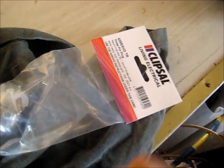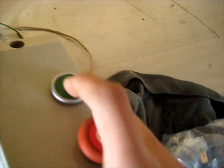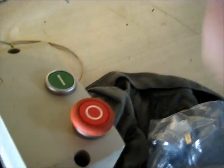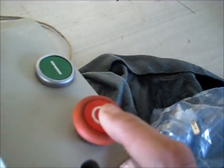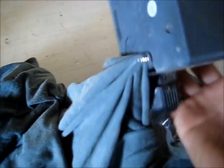I'm going to use this, hook it up to this 15 amp cord with a very heavy duty plug - 10 amp. I'm not going to be putting anything more than 10 amps through it, just make a kill panel thing out of it. So if something goes bad or something goes wrong, bang - hit that emergency stop. I might hook my ballast up with it just so I can kill things and have an emergency stop handy, just go bang and cut power altogether. Make a nice test panel switch setup.